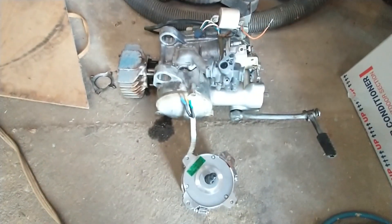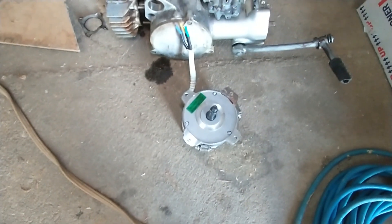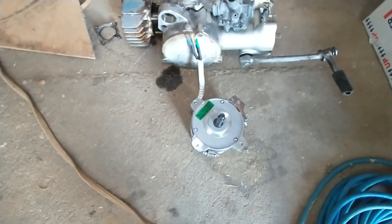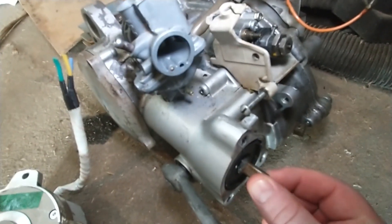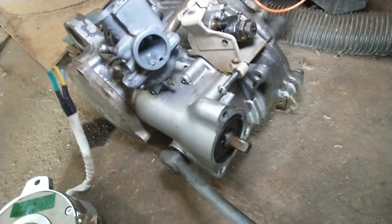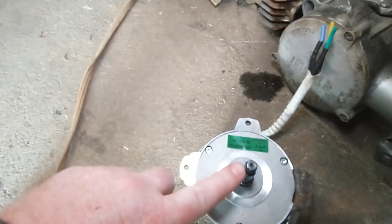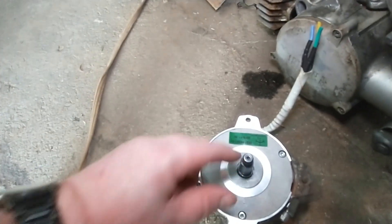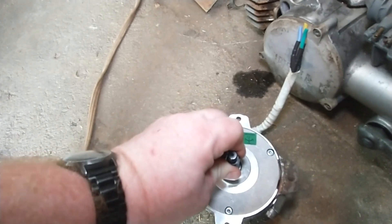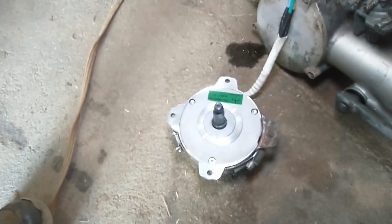That will be the replacement motor. Theoretically it should go the same speed with the new motor according to the math. The interesting thing about this unit is the output shaft is a square shank drive and it happens to be 3/8 inch - exactly the same as a socket extension. So technically all we have to do is figure out a way to connect a 3/8 inch drive socket extension to the motor or drive shaft and it'll work.